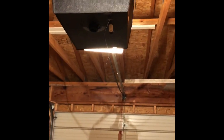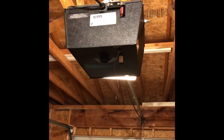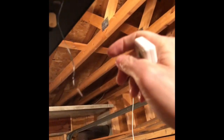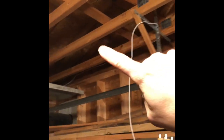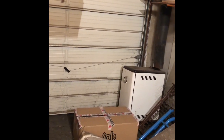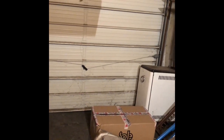I wanted to be able to open the garage door from outside. I looked online and a lot of people said you can extend the wiring to the antenna and that will fix the problem. So I stripped back the little antenna wire, got a big long piece of cable, ran it all the way down to the front of the garage and along the outside. After doing that I went outside and tested it — yes it did work from outside, but it still only worked a meter away from the cable, which wouldn't be enough from my car.